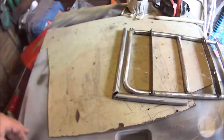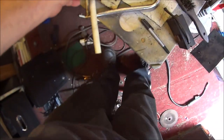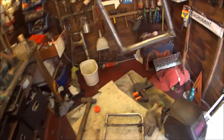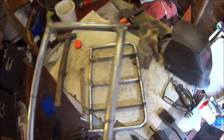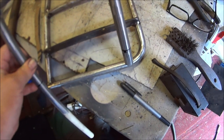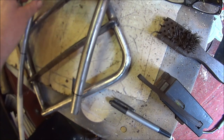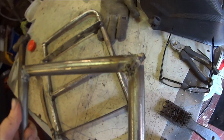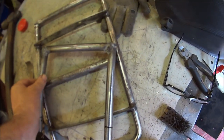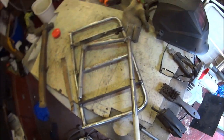I don't want to use the welder on the camera because it doesn't do the lens any good, and I can't afford to keep buying cameras, so I've got to do it off camera. So that's where I'm up to so far — I've made a J. What I've got to do is cut that bit off, cut that bit off, make a groove so they sit on there like that, and then roll that onto there. I've got to grind these down — I did some mitre cuts. I've got to cut those off like I say and stick them on there.